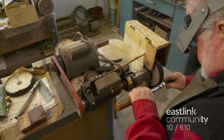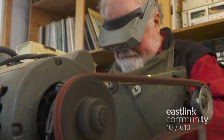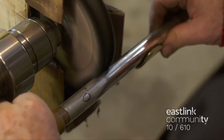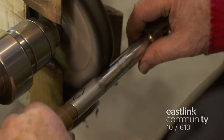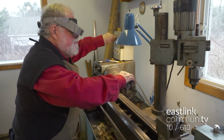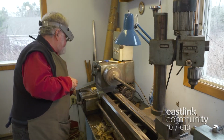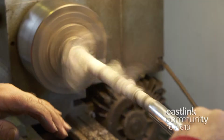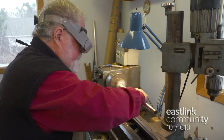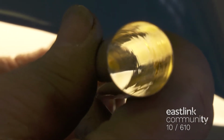A thorough buffing is the next stage of assembly. Starting with the lip plate, then moving down the tubing, and taking special care of the area around the lip plate, the head joint is completely buffed. Buffing smooths and shines the surface and helps to identify any possible imperfections. Next, the inside of the silver tube is buffed on a machinist's lathe. Buffing compound is applied to the cloth-covered steel rod. Then the tube is run along the spinning rod until there's a smooth finish on the inside. A paper-covered rod is used next to clean the inside of the tube for a nice, shiny finish.